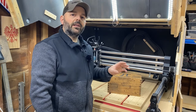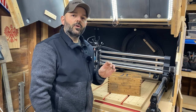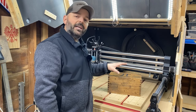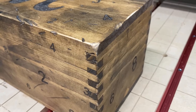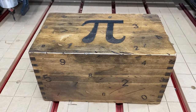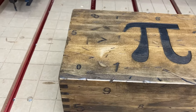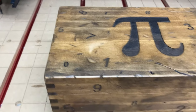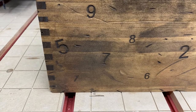When I set out to make this box, I wanted to make something unique - something that had a story to it, a little bit of history, and probably even a little bit of mystery. And I believe with this box I achieved all that. Here's a close-up. You guys can see all that aging that is now on this box due to me distressing it. I basically used a claw hammer and hit it with both ends. Certain areas, like over between the 7 and 1, I sanded down basically to the bare wood. Between the 5 and the 7, I actually added some darker stain to give it more layers.